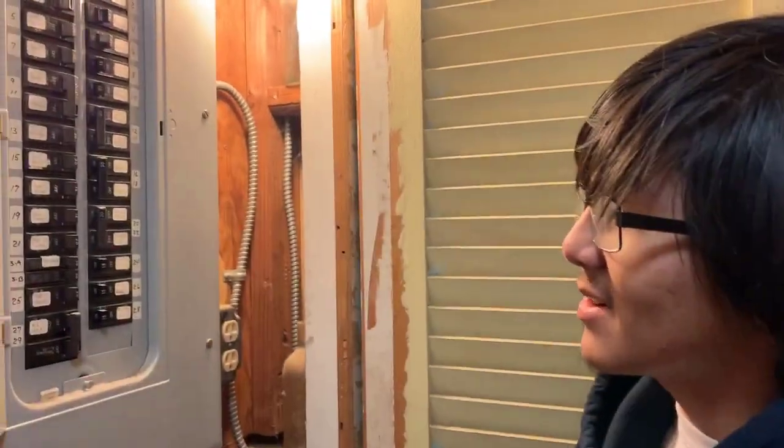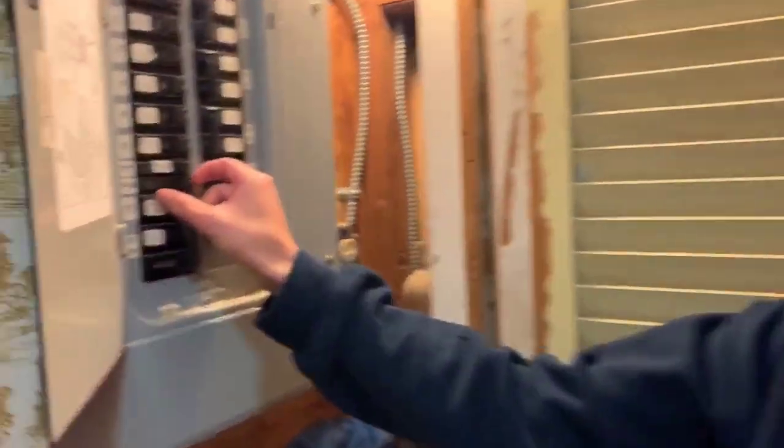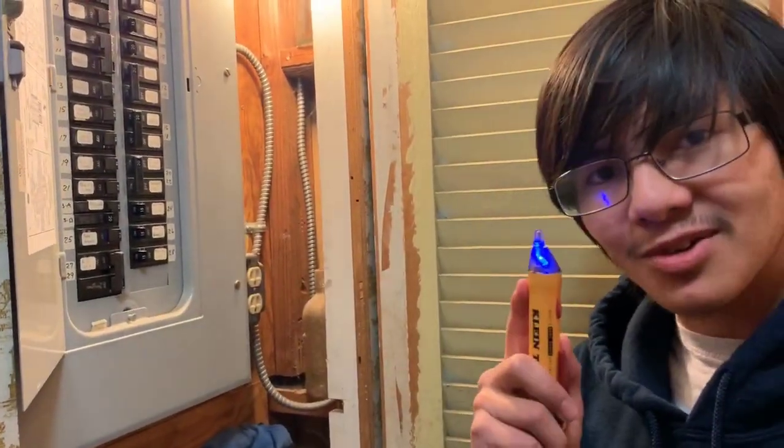If you're concerned about me dealing with electronics, please rest assured that my dad is right here — he studied electrical engineering for a while, so I'm pretty sure he's a good coach. This is our breaker; your breaker might be different, but we have everything written down. The outlet that we're working on right now should be this breaker, so just flip that off and go back up to make sure that it's the right one.